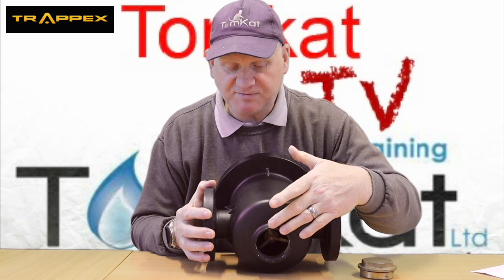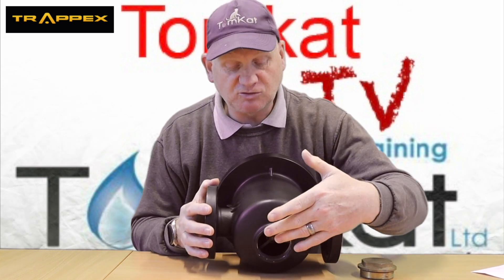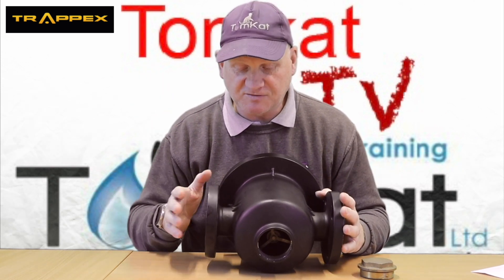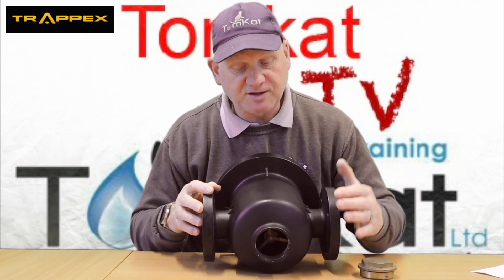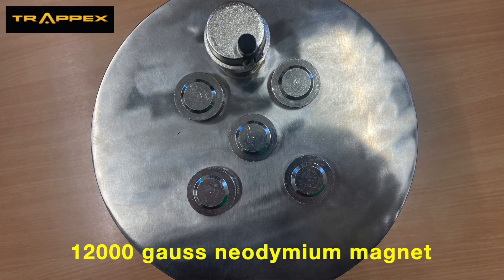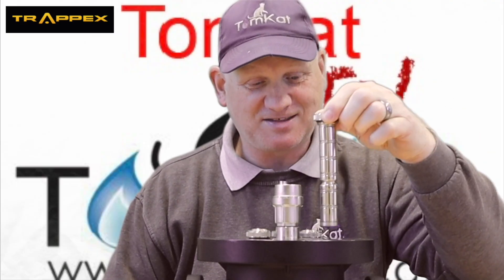There is a big two-inch brass plug at the bottom of this filter where you can put an isolation valve — which doesn't come with it — to be able to drain out the magnetite. You would isolate the two valves, take off the drain, let all the muck come out, and then use the water to blast any remaining muck out once you have removed the five 12,000-gauss magnets.